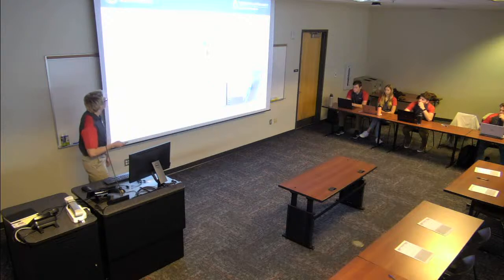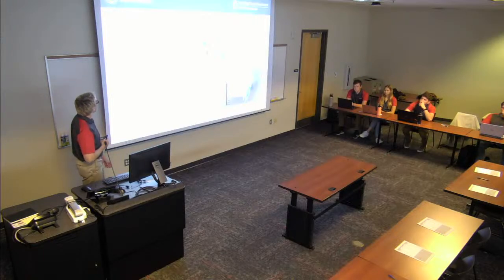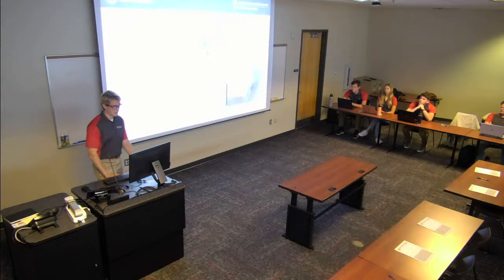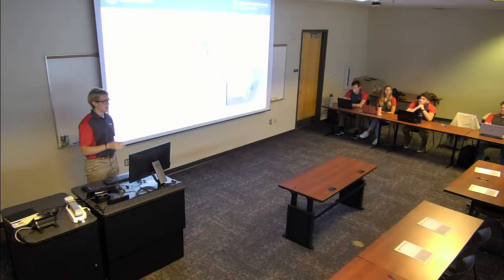So these are just some results from last year doing a 3D quarter body test. This was tested at Mach 1.7, which was at our max dynamic pressure. And our meshing results were at about a Y plus of 150, which describes how fine the mesh is close to the wall. We want that to be at a certain amount, depending on whatever turbulence models we're using in the software.